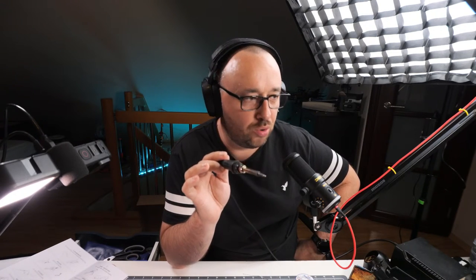When you are soldering, the metal is not perfect. This is not only a metal. The solder has impurities, it has flux inside, and so on. And when you are soldering, the gunk builds up on the top of the soldering tip. Plus, there might be metal oxides, and the metal oxide and this gunk just prohibit good thermal energy transfer between the soldering tip and the soldering pad. So we are cleaning the tip to more efficiently, faster, and better transfer the heat from the soldering iron to the solder and the soldering pad. This is the reason for that.